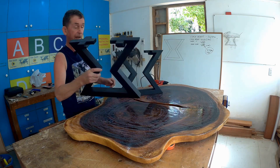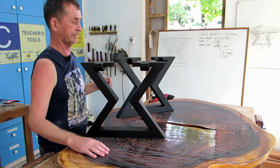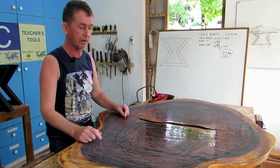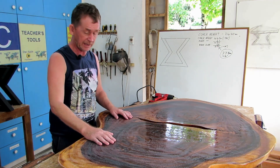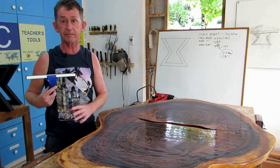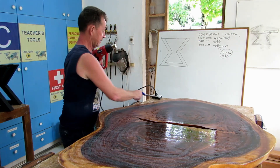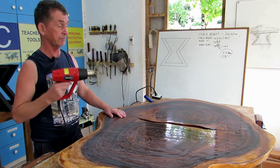The legs came out fairly nice - I'm very happy with them. Now we're on the final stretch. I've coated the slab with epoxy - the bottom is not perfect but it's sealed, and you want to seal the wood because it will warp if it's not. For the final coat of epoxy, to stop it bubbling I'm going to heat the epoxy and heat the slab slightly as well. There's a slight bit of humidity today. I'll be putting on the last coat with a squeegee instead of a roller, being very careful when mixing to get fewer bubbles. I'll heat the epoxy in hot water and use a squeegee. We will be on standby with the heat gun to kill any bubbles that come up in the first couple of hours.